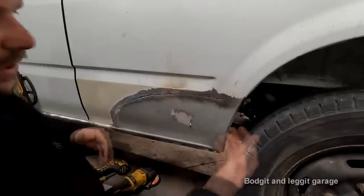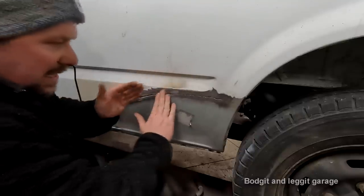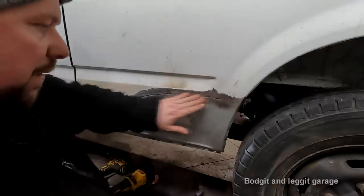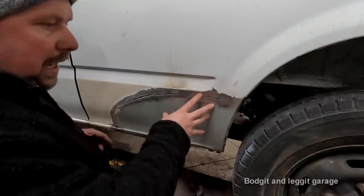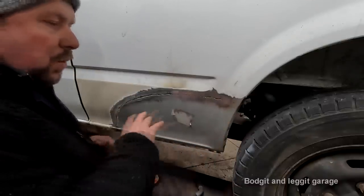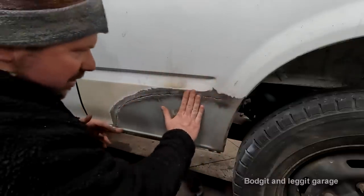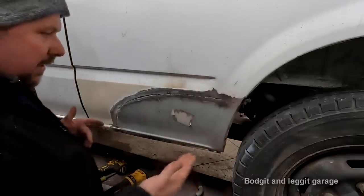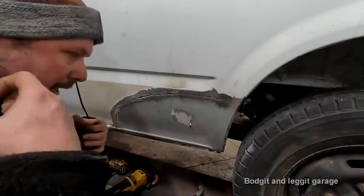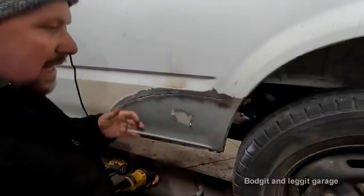So what you'd have to do then is have all the back cut out, and then you hammer form that TIG weld, and you can actually smash that TIG weld all the way down, and then you can body shape it with hammers and dollies and everything, and you will not need any fillers. But you are talking, the difference between doing this job and the job that I've just said is literally maybe 3 or 4 days longer. It is days, it's not hours, it's not minutes, it's days and days longer.